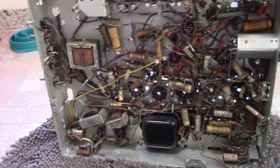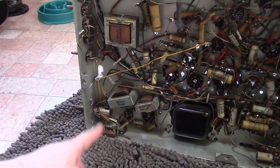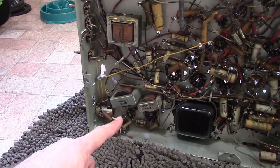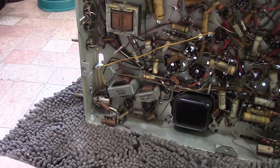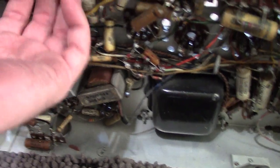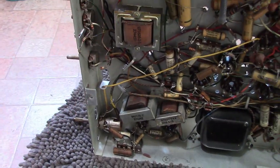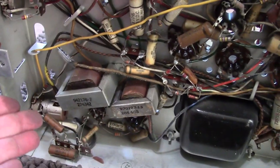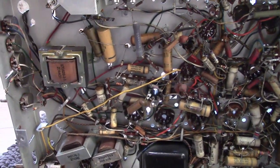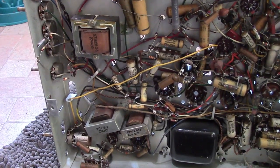While we're talking about transformers, I would save all of these. One's going to be a vertical output transformer, one's going to be an audio output transformer. The third one is probably a vertical blocking oscillator for the vertical oscillator — it would be fairly low frequency. Sometimes there's a filter choke, in which case it would only have two wires. They all have RCA part numbers on them, and it looks like this has never been serviced. So if you were to find the service info on SAMs, it would tell you what each of these is and have some basic specifications for reuse.